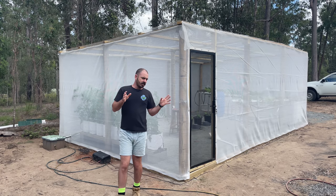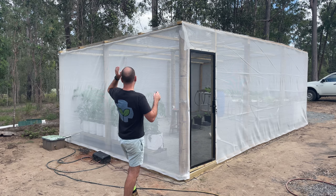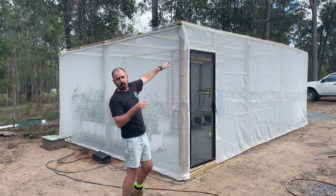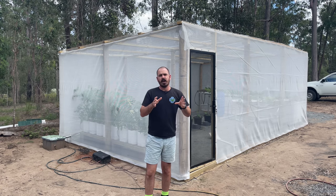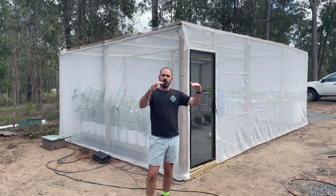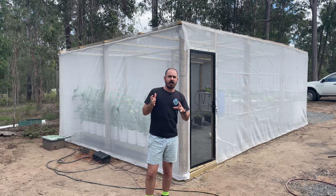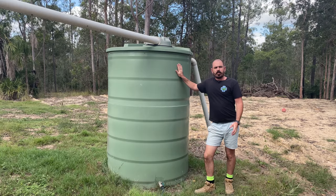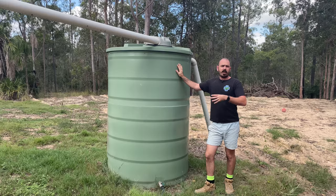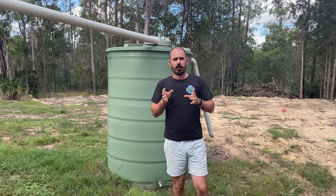The reason I say this is I've made a few mistakes over the build, including I would have liked the pitch to have been more on the roof, purely because I was originally intending this to be only a shade house without the polycarbonate on the roof. Once I had the structure in place, I changed the plan to incorporate the polycarbonate so that I can have this 3,000 litre poly water tank attached to the back guttering.